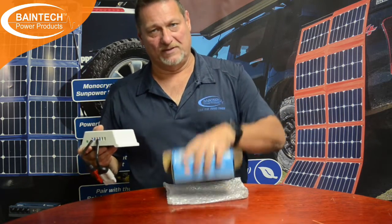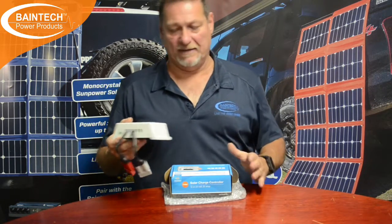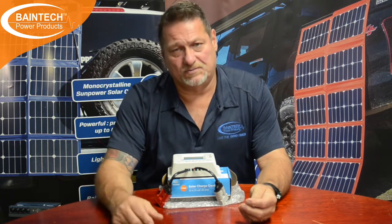However, if there is a two or three metre run of cable between where the controller on the outside of the van is and the batteries, you are going to have a little bit of voltage drop there. So it's always recommended that your charger be as close to the battery you're trying to charge as possible. For that reason I would say have a fixed one — a smaller one — inside. So if it's like a 100V/20A, or keep the 100V/30A you might have and put a 100V/50A on there to maximize your solar from the roof as well as what's coming in.